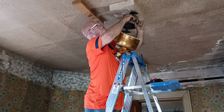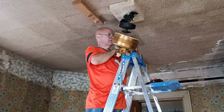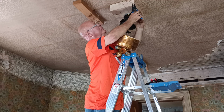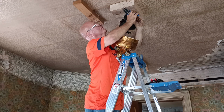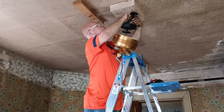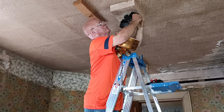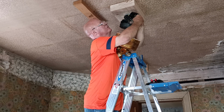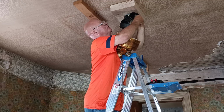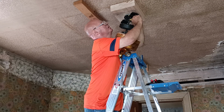Now, since we're wiring it with the light and the fan, and we're working them off the chain, there's no switch. The strip goes a little longer. Our blue wire is fairly long, so we'll just wrap them around. I'll get the insulation even at the top, and wrap my strands around like that. And the blue one over for the lights. Put the strands at the bottom and wrap them around so that they're even at the top there. I'll have insulation even at the bottom and the copper even at the top. Stick my wire nut on here. Make sure it's nice and tight.